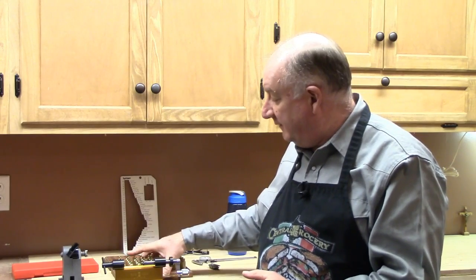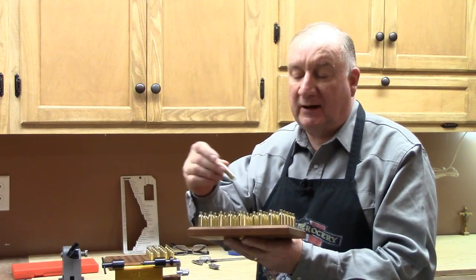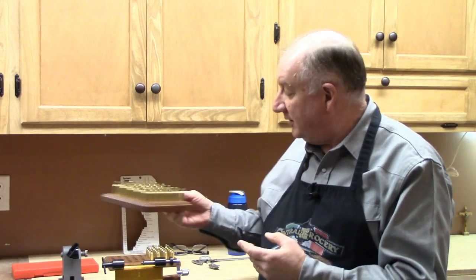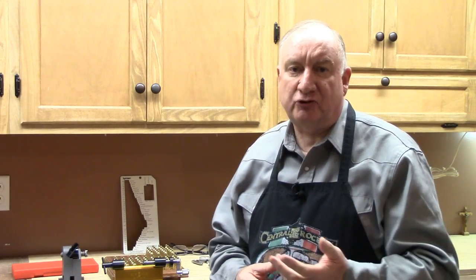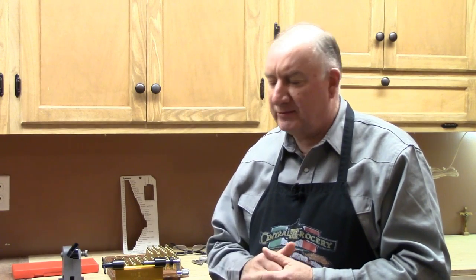Welcome back. In my last video, I discussed the essentials of case preparation, which involves merely inspection of the cases for correct functioning, making sure that they're to dimension, and that they suffer no defects, and also checking them for case length and trimming where necessary, and how to chamfer and deburr the cases. Those are the essential steps.